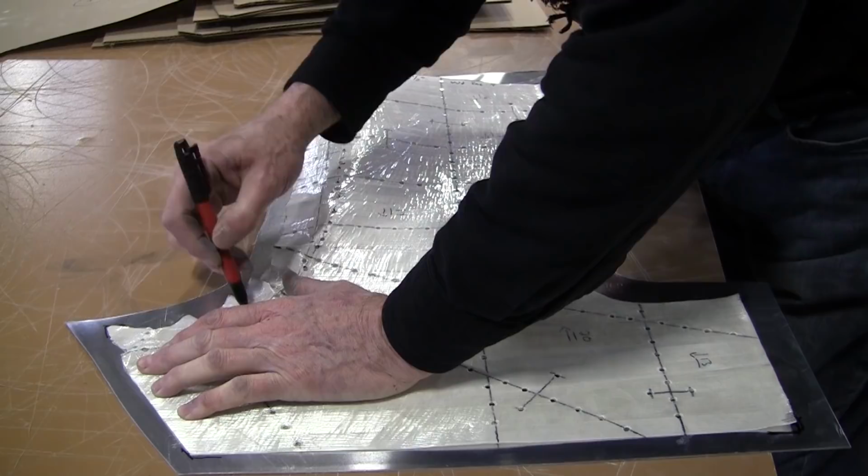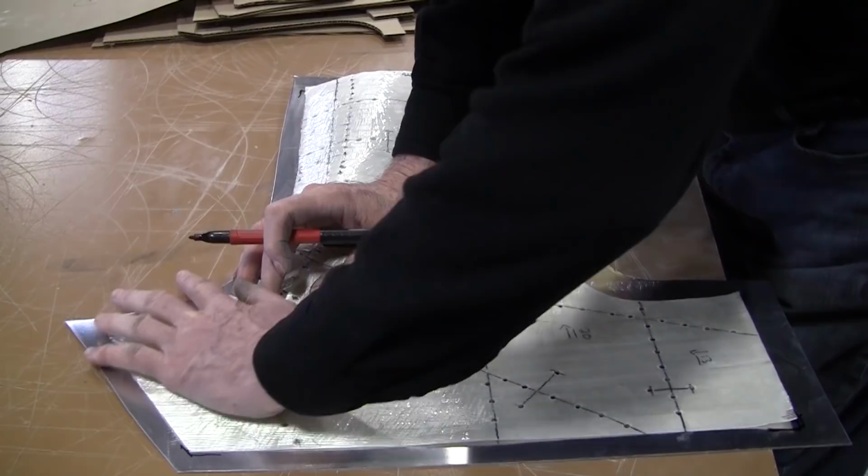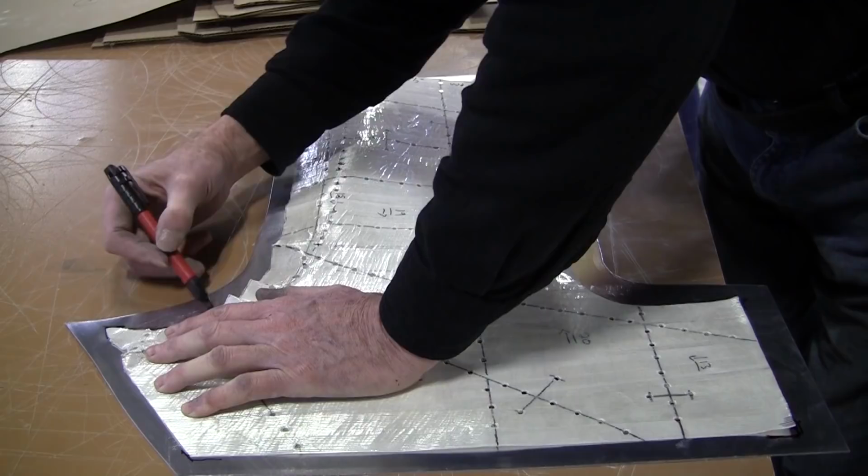And when I stretch this flange, I don't want to go beyond that line, because you don't want to get that stretch inboard here. You want that stretch only to go to here. It's a tapered deal, where you're going to open that up like that. And there's a bunch of different ways to open that up, and I'm probably going to cut some more away here, because otherwise we're going to have to remove a lot of flange material there, or move a lot of flange material.